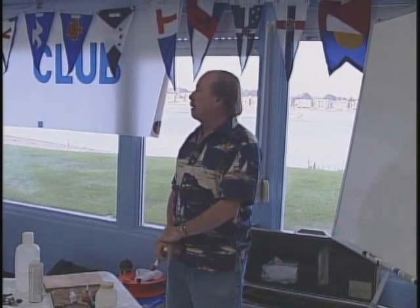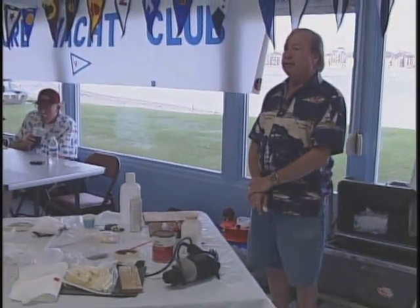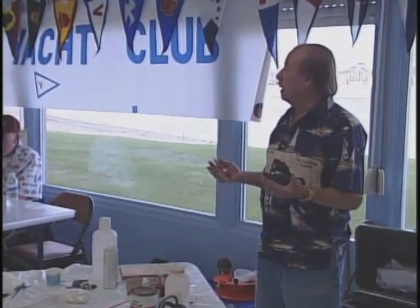We're going to talk about plastic boats, which all of us have. They're all made out of polyester resin. So if you're wanting to do some repairs on your boat, you probably shouldn't use epoxy because you don't have an epoxy carbon fiber boat. You don't have a composite boat. You have a boat made out of polyester resin, so any repairs that you do should be polyester resin also.